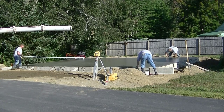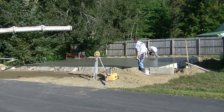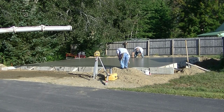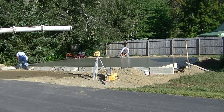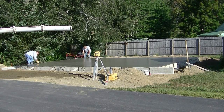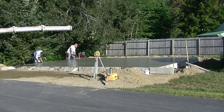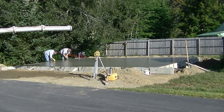If you get those anchor bolts in at the right time they set in there really easy. The homeowner didn't lay out the walls for us, so we're just setting them in about every four feet — if one ends up where a stud goes they'll just cut it off with a Sawzall. That's how you pour a concrete slab: get the concrete down, have your laser there so you can set a pad in the middle — a wet pad like we do, or some type of pipe screed or two-by-four screed to go off from in the middle. Use the top of the form on the outside, get it leveled, and then run the bull float across. Stay tuned for part three where I'll show you how we power trowel this for a nice smooth finish.